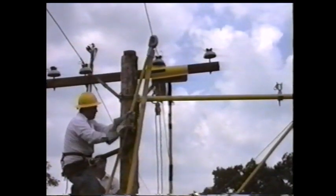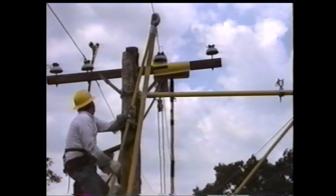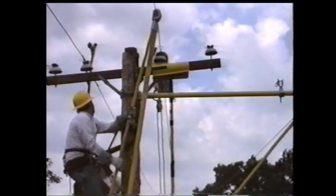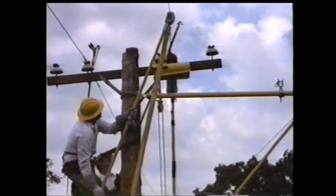After the conductor is untied, have ground personnel pull on the blocks that are rigged to the 2.5-inch by 14-foot wire tong. When proper lift is met, push the conductor out until it rests in the conductor holder on the auxiliary sidearm. Make sure that the conductor is locked into the holder.